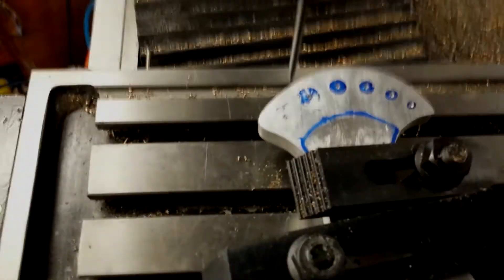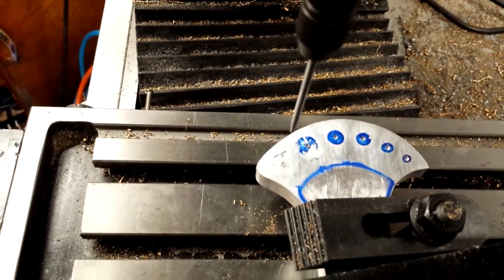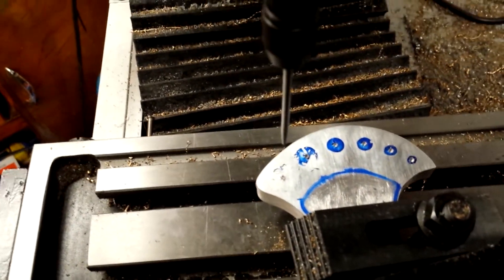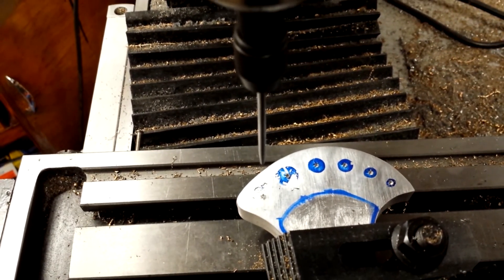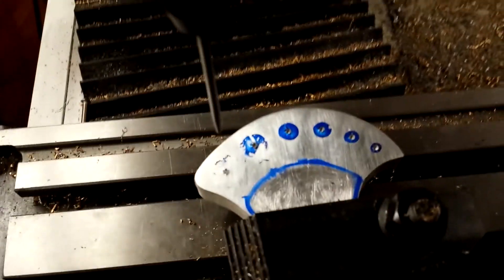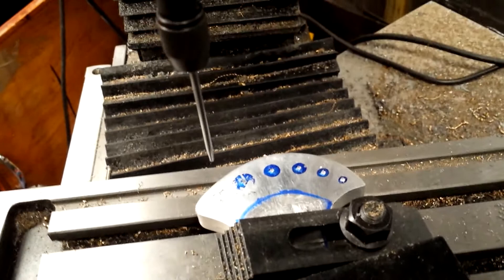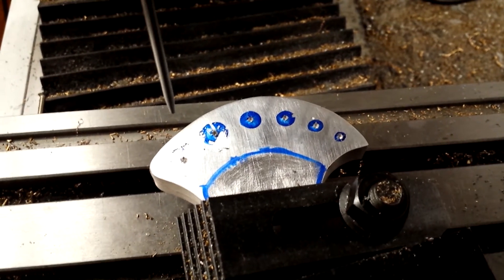The top of the standard is going to have a curved row of holes for decorative purposes — purely for the look. These holes will decrease in size from 12mm diameter down to 4mm diameter at the right-hand side. It's absolutely vital that these are kept as correctly spaced according to my original layout as possible, otherwise they'll just look clumsy and awkward. I've punch-marked all the centres of the holes, which were marked out using a plastic stencil with different sizes of circles on it. Now I'm picking up the centres of the holes with the wiggler in order to keep it as true as I can to the layout. Then I'm going to centre-drill and drill each hole out to size.